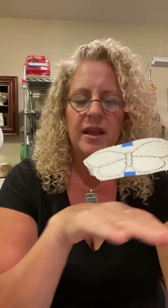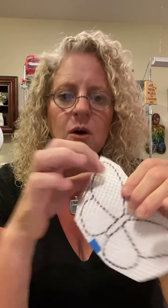So what happened was, when I went to put the layer of thin set down, and I took my mosaic and I stuck it on the thin set, it didn't last. It actually came up in sheets. And the reason why is because the fiberglass mesh wasn't attached to the thin set. My weld bond was attached to the thin set.